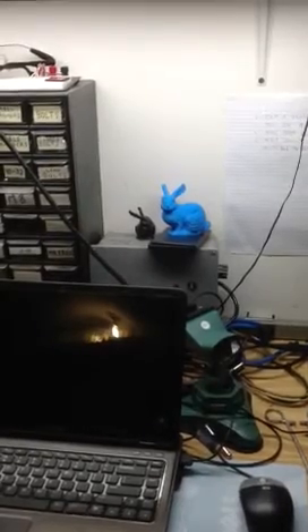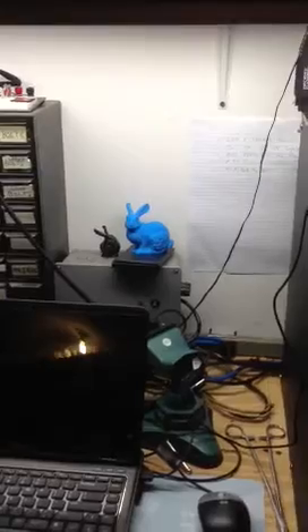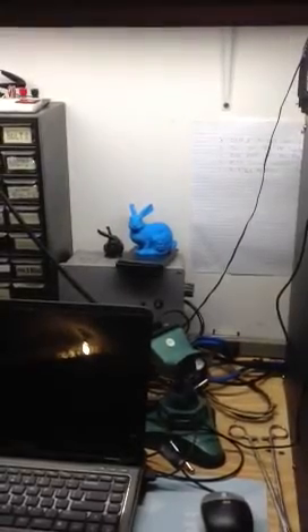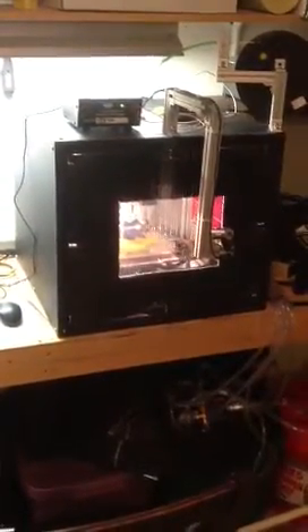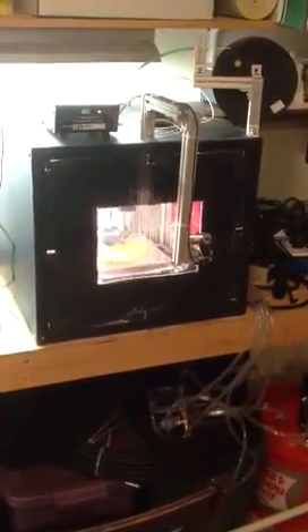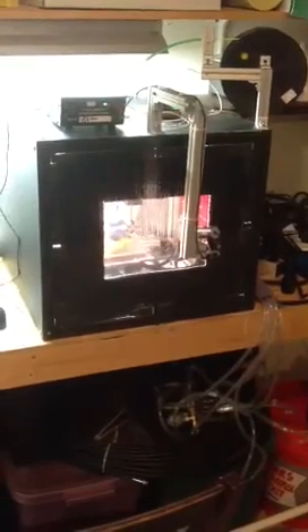The little tiny one is the first one I printed with my old printer. The blue one with some cracks in it from delamination is what I did with this printer before I used the enclosed build chamber. Now I should be able to make a really big one with no delamination using my 3D printer, which is enclosed with insulated walls and heat sources running at 70 degrees Celsius. My extruder is at 230 Celsius, and I will show the result when this is all done.